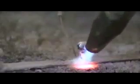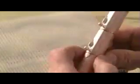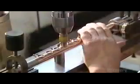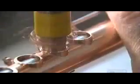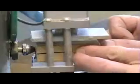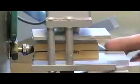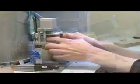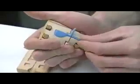They solder little posts onto 3 strips of metal called ribs. The ribs and posts will later hold the flute's keys in place. Next, they use what's called a profile cutter to shave the tone holes by minute amounts to perfect the flute's sound. Now, using a wax injector and rubber molds, they create wax duplicates of the 120 different parts that make up the flute's 20 keys.